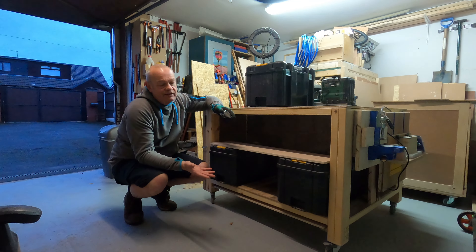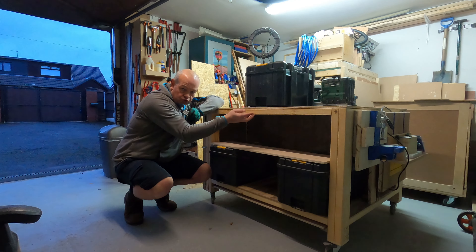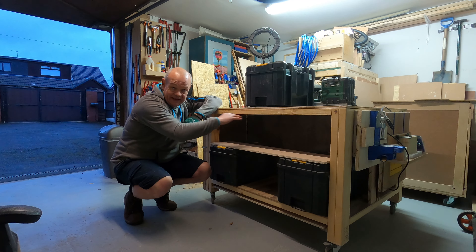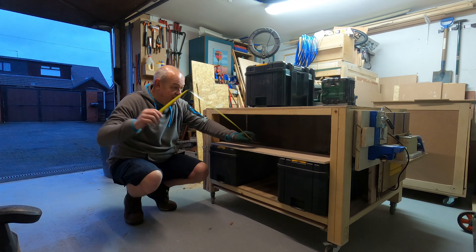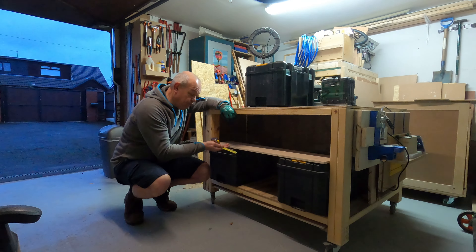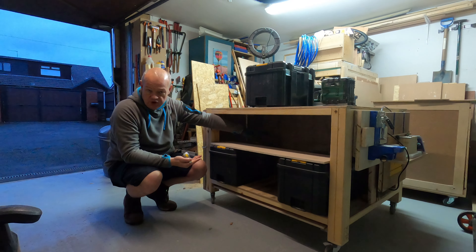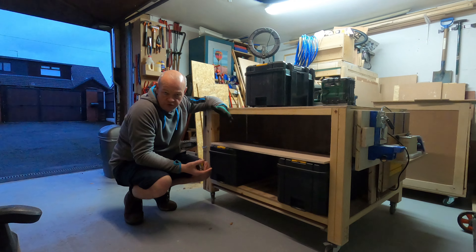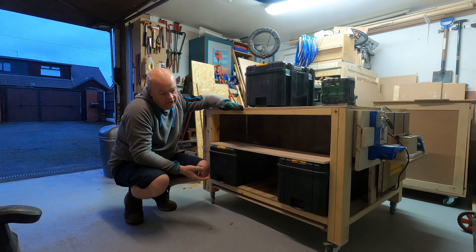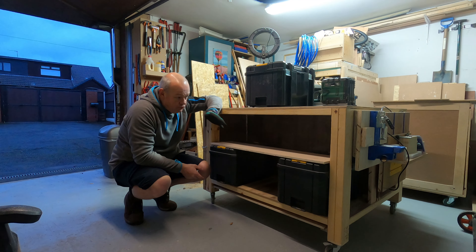On this side I've got about 24.7, in the middle I've got bang on 25, and over this side I've got 25.2. There's a little bit of variation — it could be the straightness of the wood, the way I put it together, or a bit of sag. What I want to do is keep the drawer unit true to the top brace. So when I make the drawer I'm going to make it level with the top, which gives me at its lowest point 24.5 cm to play with. I'm now going to make a box that's 24 cm deep and just put two struts in — I'm not going to use all of the depth available.